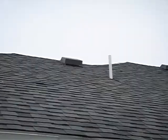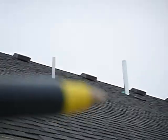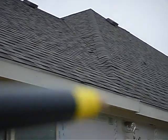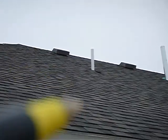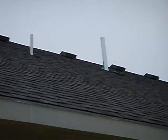All these plumbing pipes should be flashed. There's flashing in the garage hanging on the wall — that's what's known as a clue. The furnace vent cap is not installed either; they're probably waiting to put the flashing on before they install the vent cap. There's that peculiar roofing detail I was speaking of earlier. Once these are flashed and that cap is installed, these pipes should be painted to protect them from the UV rays. I see most of the neighbors' pipes are painted, so I imagine the builder would maintain that.